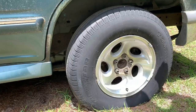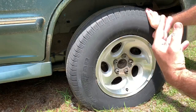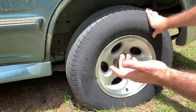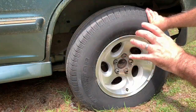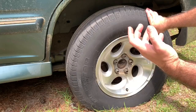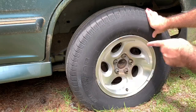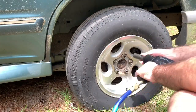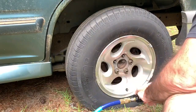All right guys, here it is with my helper tank added to it. It should be better because there'll be more line pressure. I have my pressure gauge set to 120 pounds, but it can't consistently deliver that because it's such a small tank. With the helper tank, it should take them right off and put them right back on without struggling. See how much more pressure I got with that extra volume.